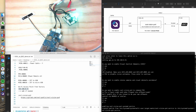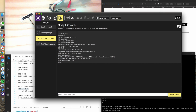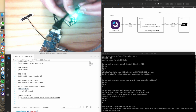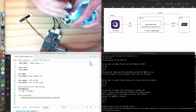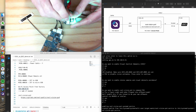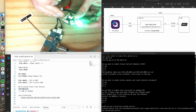So for troubleshooting, if for some reason you've messed around with the settings on the flight core, you can connect over USB, which let me move this out of the way. If you needed to connect straight up to the flight core through USB, you could use one of the 2 cables we have. It's basically a 4-pin JST to USB, and you could go into port J3 on the new combo board. It's actually a blue port. We're going to make all of our USB ports blue in the future, but if you need to find the right connector, just go to the docs.